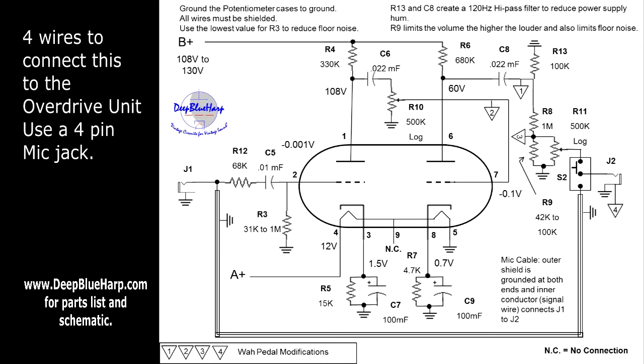In the original circuit you'll notice there are four triangles. One is located near C8, top right of the picture, labeled 1. The next one is the bottom of R8, labeled 3. You'll see a triangle labeled 2 — it's downstream of R10, and that's actually the signal supplying to or back from the LC circuit. Triangle 4 on jack 2 on the very right-hand side is connected to ground, because the unit will require a shielded enclosure which is also tied back to the original overdrive unit.